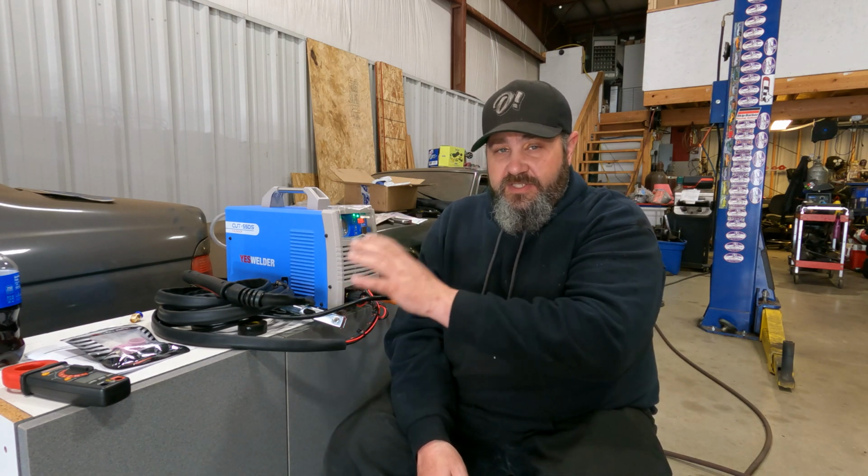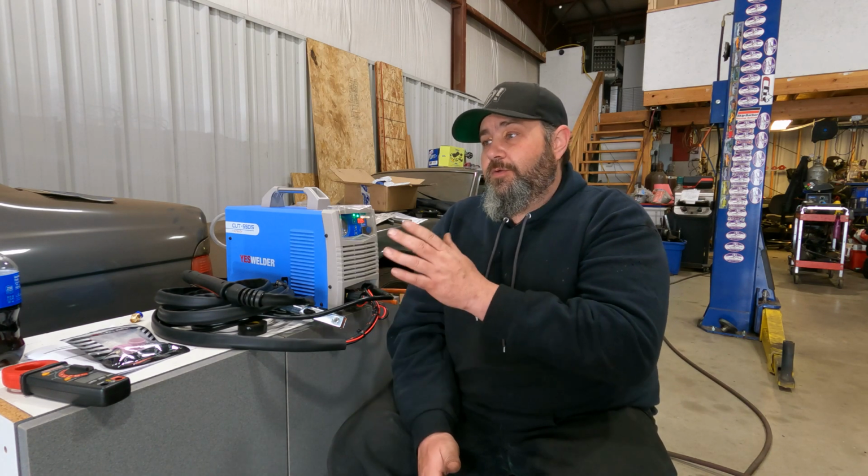Now in the manual, it states basically 1/4 inch plate is your limit. So we're right at the top end of it. And with the larger tip, I could not cut through the 1/4 inch plate. It would gouge it, but it wouldn't cut through it. I ended up switching to the 30 thousandths tip, running it at 220 volts, at full 55 amps. And truthfully, it actually cuts through 1/4 inch a lot nicer than my ESAB does. I would imagine that's because of the extra 10 amps that it's putting out versus the ESAB. So we're on a mission, and we're getting pretty good results with it.